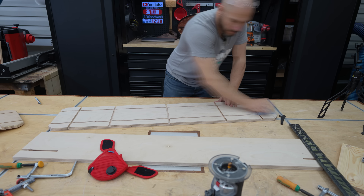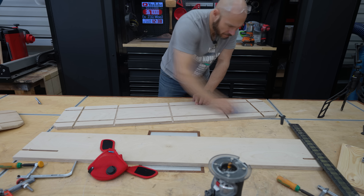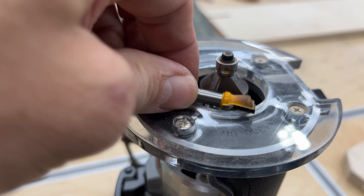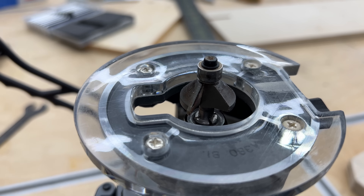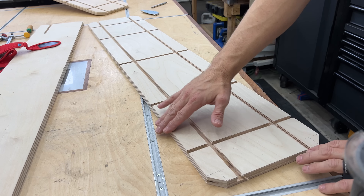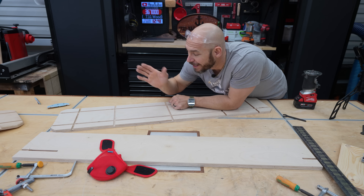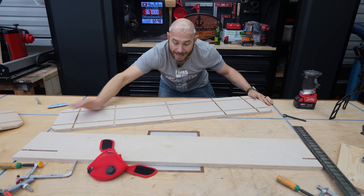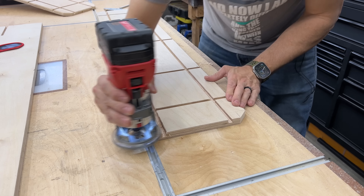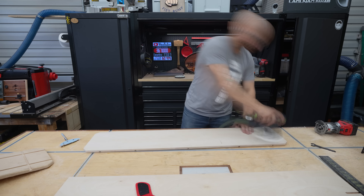We cut those two long grooves. Now all we have to do is divide this up to cut our cross grooves. You're gonna measure off the end four inches on both ends. These don't have to be precise — you're not building a clock, you're building a jointing jig. So if it's close, it's fine. Make a mark right in the center at two feet or 24 inches. Then divide that in half again and make a mark at one foot and three feet. That's gonna be our grooves — we're gonna have five grooves going across.